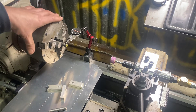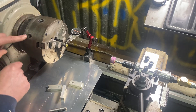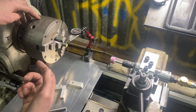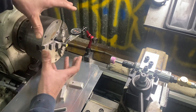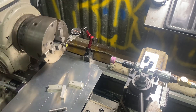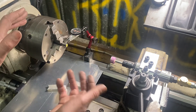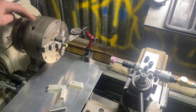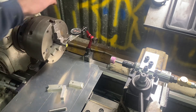Because this is an Adjust-True chuck, you can adjust it on the back plate — there are four little set screws that go all the way around it. Before I started, I indicated the body to the backplate, which actually made it even worse, but now I'm right in the center of the plate getting four thousandths of runout. What I'm going to do next is pull this completely off, take it apart, get all the hardened metal out and get it completely cleaned, then adjust those four screws and I'll probably get that four thousandths to come out.